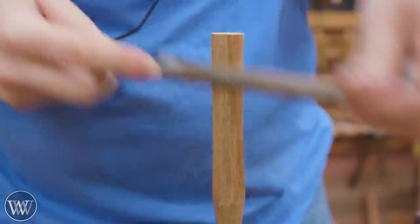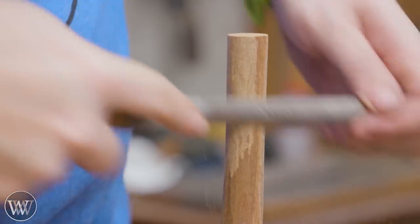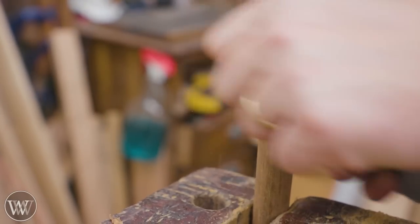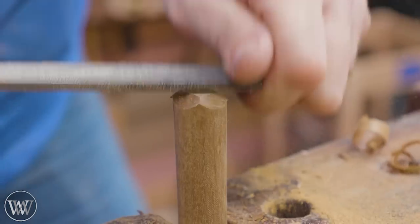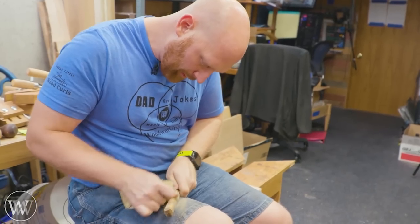Just like before, we're going to do it with a file and rasp and smooth it down. This one is actually made out of Ipe, which is a really nice, durable wood - it takes a little bit more work but it really comes out nicely. We'll shape the end on this one the same way, with very heavy chamfers on it that turn it into a square or slight rectangle on the end. Then come in and file it smooth, and you get a really nice, detailed surface.